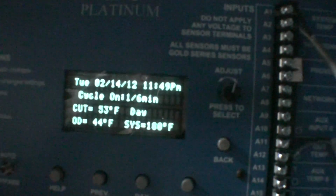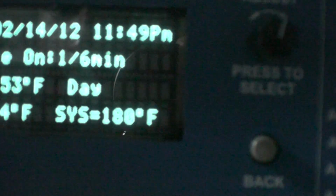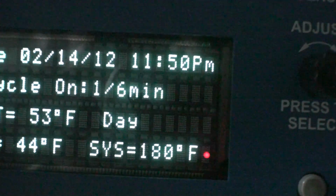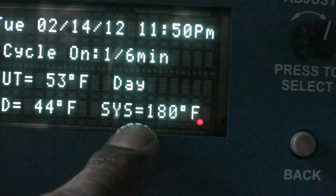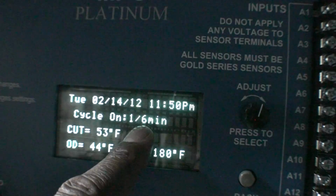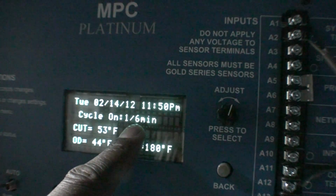Is that when you're setting up your boiler for the heat timer, pretty much what you never want to do is you don't want to go off of the temperature. As you can see, when I run it, my heat circulation is established and the countdown is for 6 minutes. I set the temperature, which is the system temp right here, according to how much steam pressure I have in the gauge that you're looking at right up there. If I can get this to focus for a second. So when I get about 2.5 pounds of steam pressure, I know pretty much that the entire building has been heated. Then I can begin my countdown, which will run for about 5 to 6 minutes, and then she'll shut the operation down.